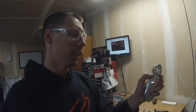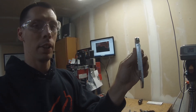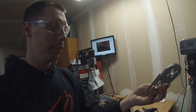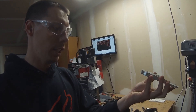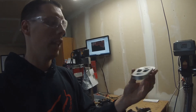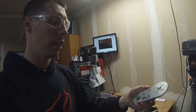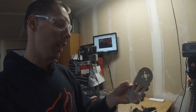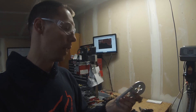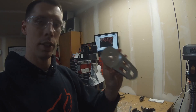A couple of things — right here I've got where the tool is rubbing or scuffing the surface, so there's a rough patch, but that's easily sandable or polishable, so not really a big deal. That's really the only downside to doing it this way. It's really nice not having to flip the part — I tried going only halfway down, flipping it, and it was hit-or-miss trying to line it up, so I finally gave up and realized I could plunge the eighth-inch down farther as long as I keep the chips out of the way. That's definitely the best way to do it, and it turns out pretty good.